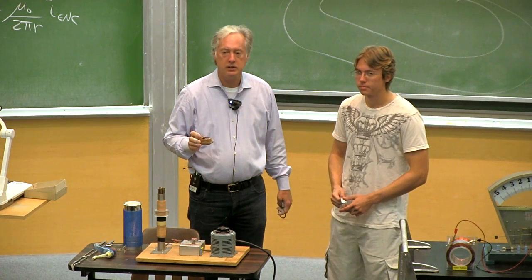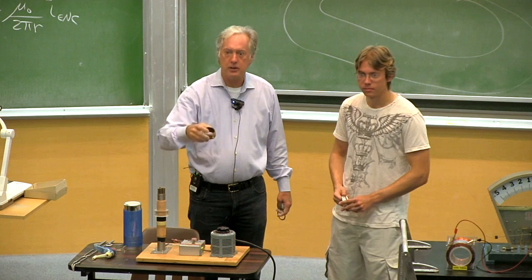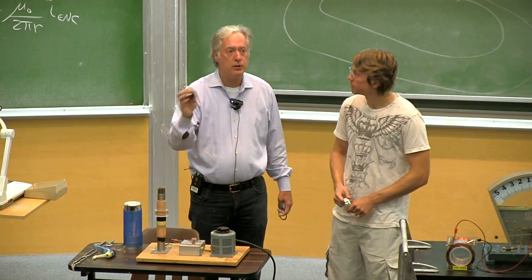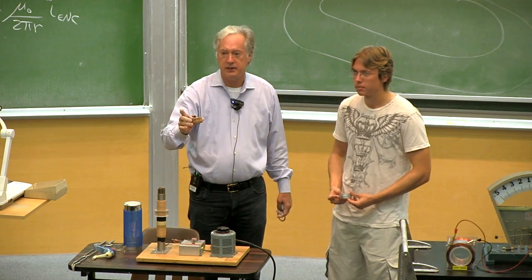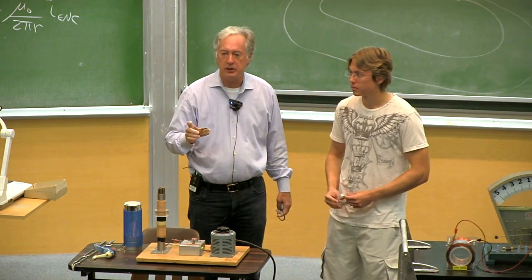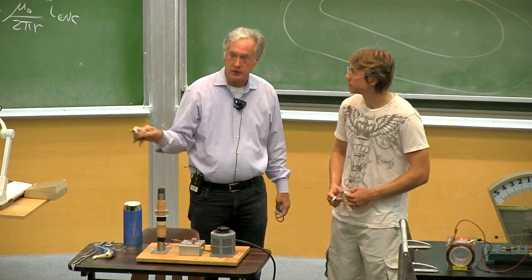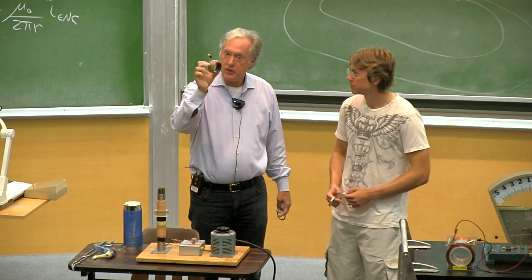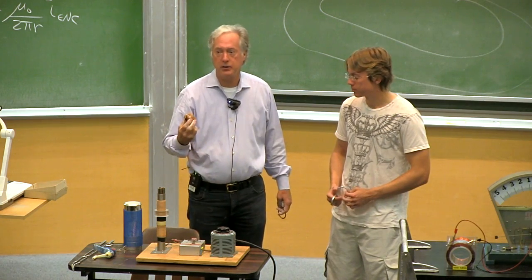What's the force law? F equals dp/dt, right? And in electric and magnetic forces, what's the Lorentz law? F equals qE plus qv cross B. Q times E. Electric fields push electric charges, right? So that means there's an electric field in this wire when the magnetic flux is changing.